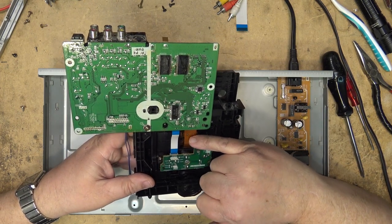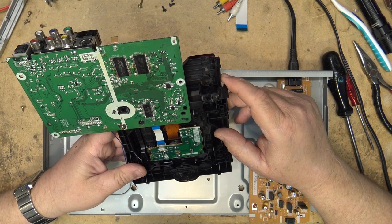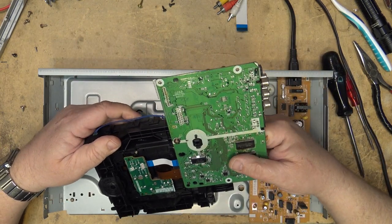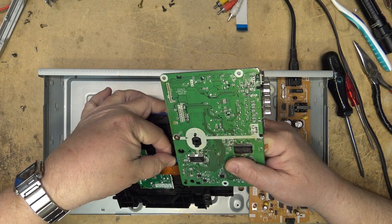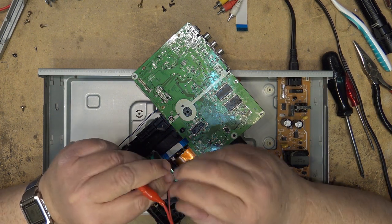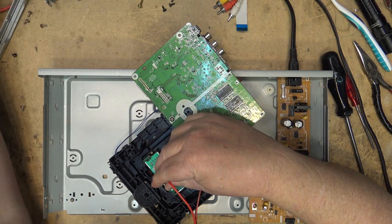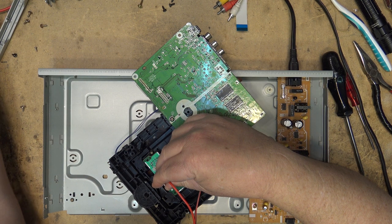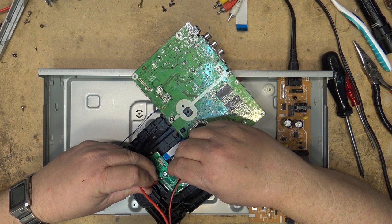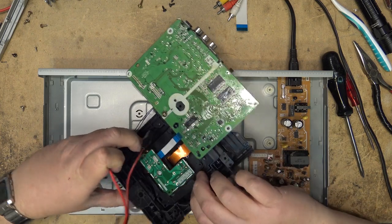You can see this one has two shorting tabs for the infrared and the visible laser. What I want to do is apply my power supply across the motor here and give this thing a good run. I'm going to unplug the power connector that connects the motor to the servo circuit so I don't burn anything out, then clip my power supply across the motor and let this thing just scream. I think that might be the problem — this is putting out a lot of vibration. It might be the motor going bad.